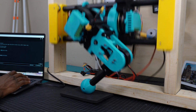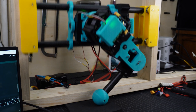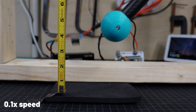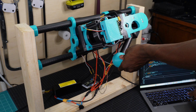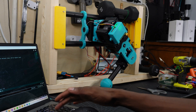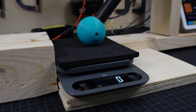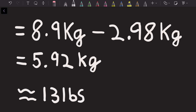We can make small frequent jumps or a single large jump. It can jump fairly high, but because the tape measure moved, I don't have an exact measurement. For the final test, I want to see how much weight the leg can hold. We'll start by trying 5 lbs, then 10 lbs. I also did some rudimentary tests on a scale, and it looks like the max weight the leg can hold is about 13 lbs.